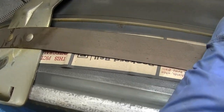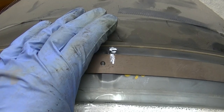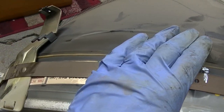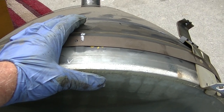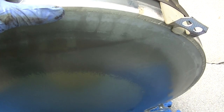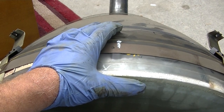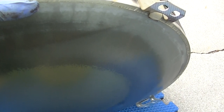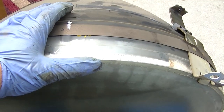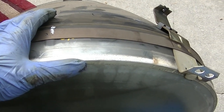It is the original Packard Bell tube. And yeah, I'm gonna have to take the support band off. I marked it simply because I'm the first one to take this CRT out of this set since it was installed by the factory. The other thing I would say about doing this is, if you can't deadlift 100 pounds straight up and hold on to that amount of weight and manipulate it around, maybe don't try and do this, because this is heavy, and if you lose control of it, if you drop it, you're going to regret it.